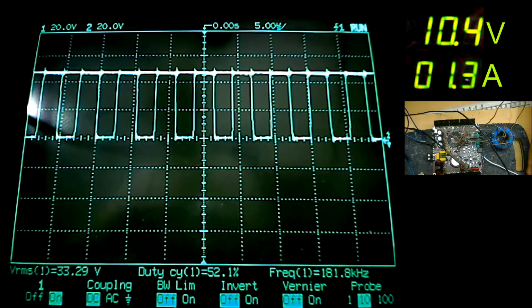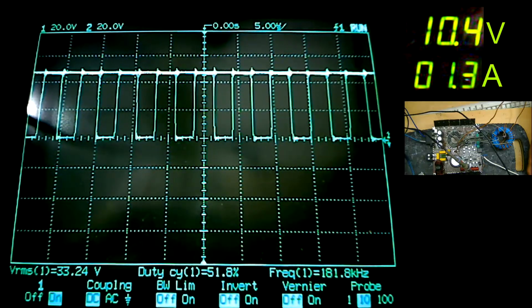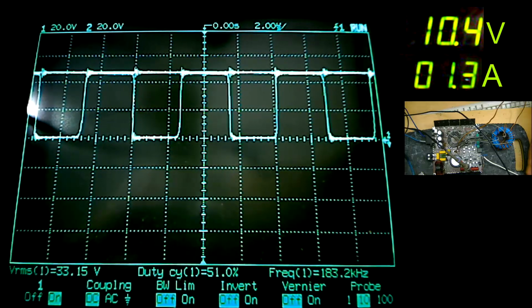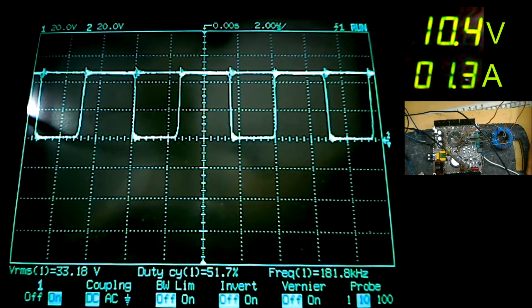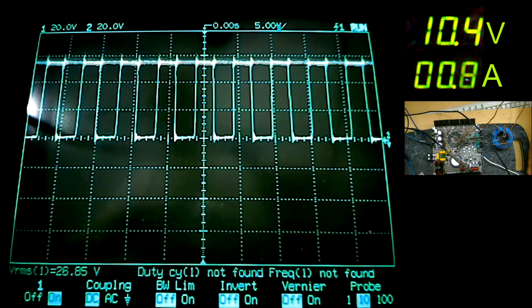I believe part of what caused this was the much lower rail voltage of around 46 volts I was using here, which prevented good feedback to the chip for self-oscillation. And the reason I think that is because when the flyback effect boosted the rail voltage high enough to about the 60 volt mark, the oscillation kicked in just fine.